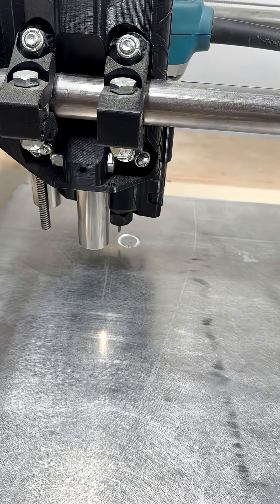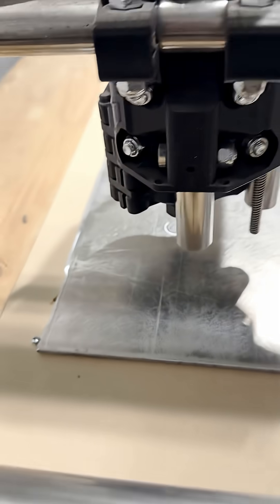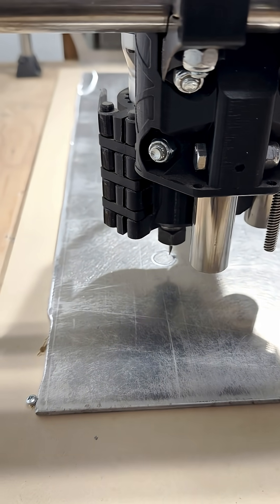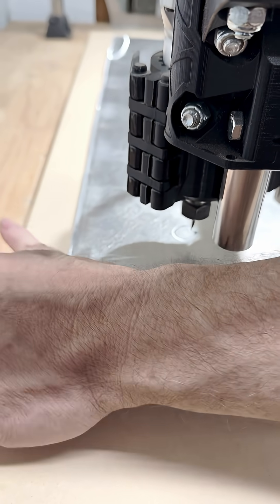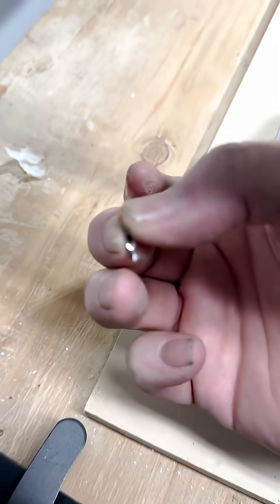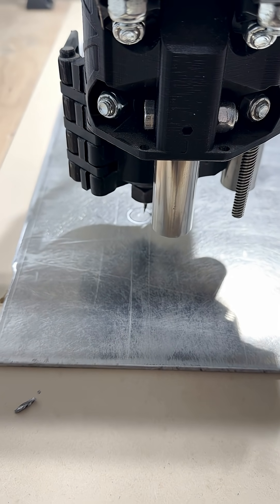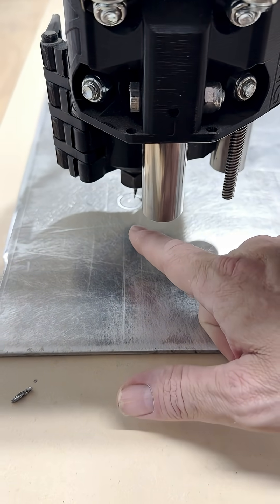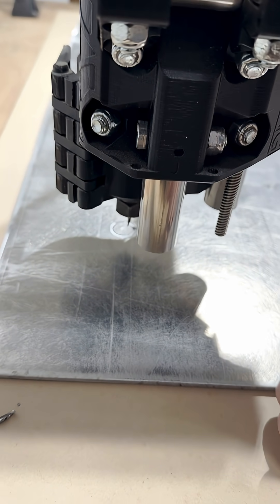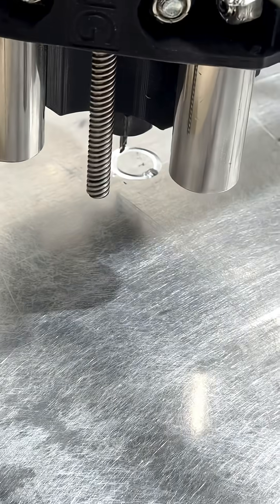As you can see, I ordered more bits. The feed rate was a little fast — you're gonna see it on the video. I snapped that off; it was a cheap bit anyway, not a real good one. I got a pack of ten ordered this time and I'm going to increase the number of passes and slow the feed rate down a little bit more. It was cutting pretty slow at first and then it just died.